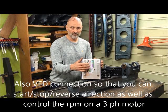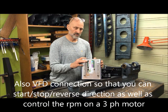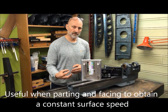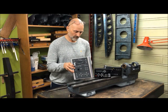You can also connect a VFD so that you have a three-phase motor controlled directly from the user interface, which is a big improvement. For instance, when parting, you can run a constant surface speed as the diameter of the workpiece gets smaller.